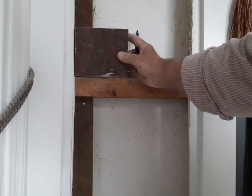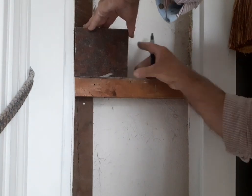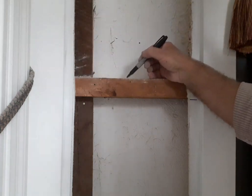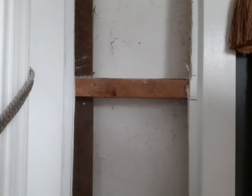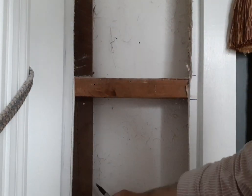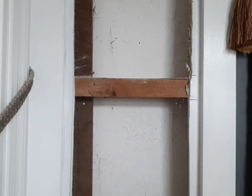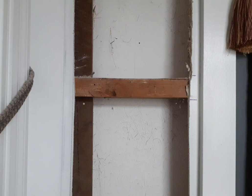Now we're back to figuring. I want the marble to actually sit flush so the frame goes around it and it looks good. I need to measure off at the back where it is flush, and I need to cut through that nogging — that one and that one — the same. Then the marble will go into the wall, resting on a plate I'll put down there, and the frame will go around it. It will be beautiful and sit back from the one below. It looks better to my way of thinking, and until it's finished we won't know.